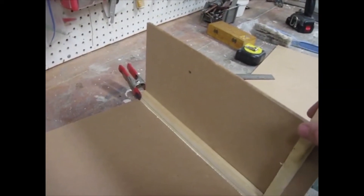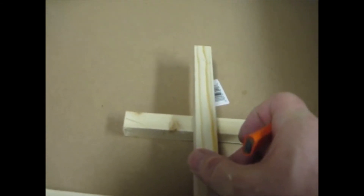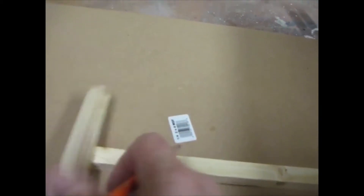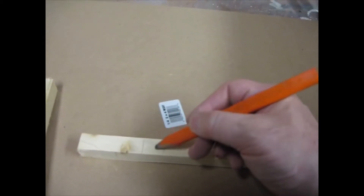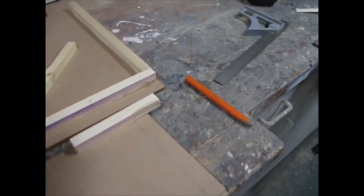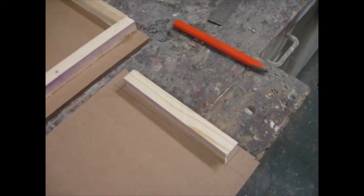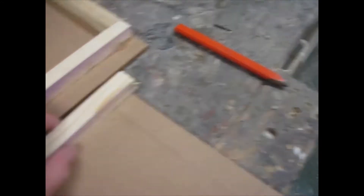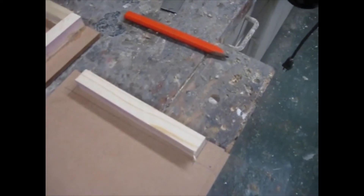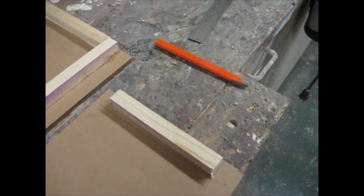What I need to do is put a gusset on here, so I'm going to mark the measure. I want to mark the edge, but if I cut it on this line, that's going to be a bad thing. What I need to do is leave room for the gusset on the other top-bottom piece. So I'm going to take my measurement of a gusset, and this will be the line that I cut on right here — that'll give me enough room for the gusset that goes across the top piece. I want to get this gusset centered on the side piece. I marked where the top and bottom gussets are going to go, and that gives me a range where I can stick this gusset. So I'll go ahead and glue those up and tack them together.